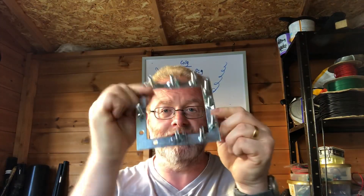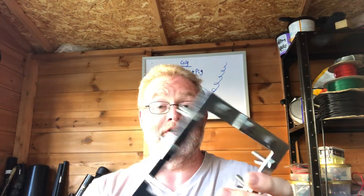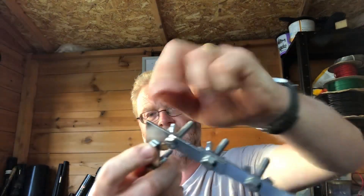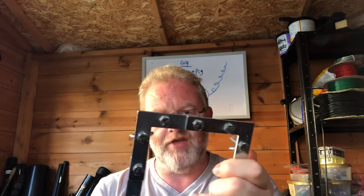So I came up with this idea — in fact it wasn't me, I should say, I'm using an idea that somebody else came up with, and I'll give him credit in a minute. But it's literally this — four pieces of L-shaped zinc-effect bits of metal, with holes pre-drilled. I think these are M6, and you get some wing nuts and bolts — job done. You can see that some of them hold the structure together with the holes, and some of them are just free. To attach a radial, or a bunch of radials, all you do is unscrew that, slide the fork connector in, tighten it back up — Bob's your uncle. You can adapt the size, make it long and thin, do what you want with it. The whole thing came to about five to ten dollars, nice and easy to use.